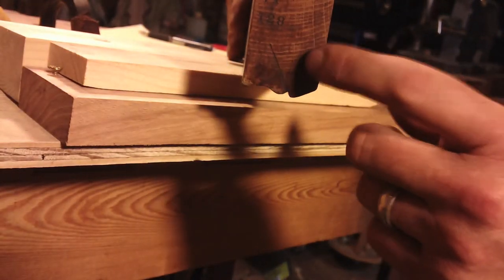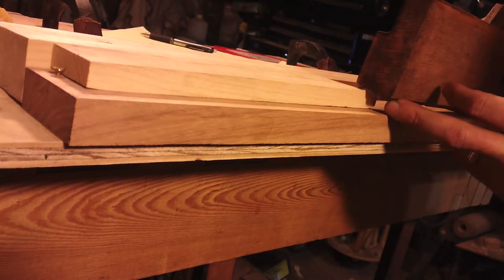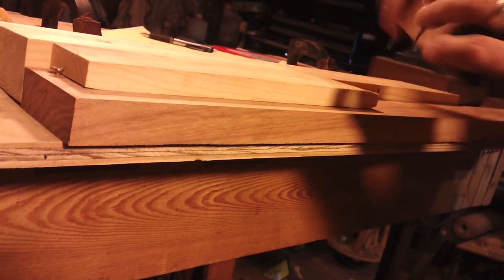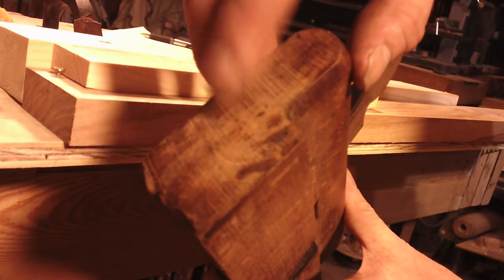The spring mark is on the front of it, because you line it up by eye at the beginning, and then you follow through with the push. Your sprung lines are on the front, because when you're cutting your piece, you're lining it up with your eye to the piece at the beginning. It's rare that you ever see sprung lines on the side.